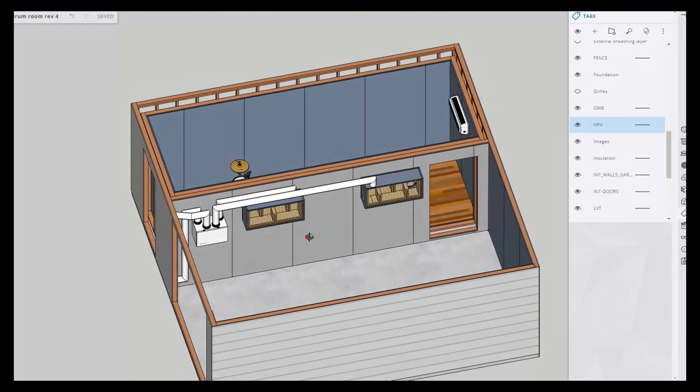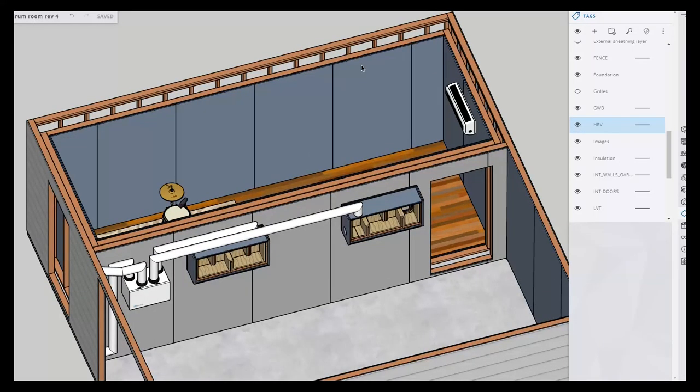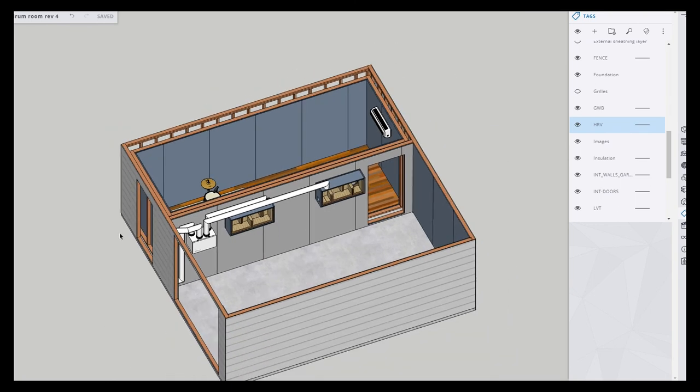But in summary, for this design concept, we've built a room within a room on the existing slab. There's the mass-spring-mass concept, pretty robust construction, especially in terms of finishes. It'll be heating and cooling from a split type system. It'll be ventilating from a separate ventilation system. That'll be part of here. And that will hopefully improve the acoustic control and separation for my live practice room from the outside and from the neighbors.